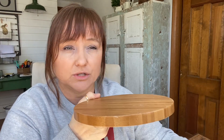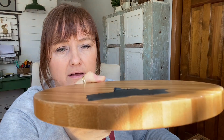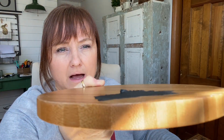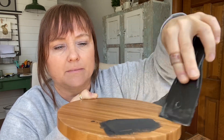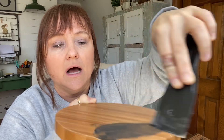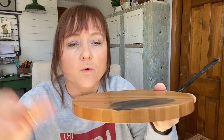So you definitely do not want to dip back in. The more and more you use it, you'll be able to tell how much you need for the screw holes or the veneer you're filling. And then after you've used it, do not put the excess back in — it's going to ruin the whole batch of mud. You don't have to use a ton; obviously what you're filling will determine how much you use. Those are tips I've learned using this stuff over the years.